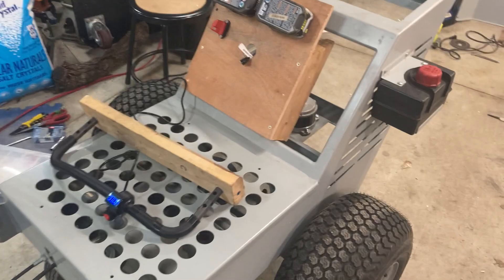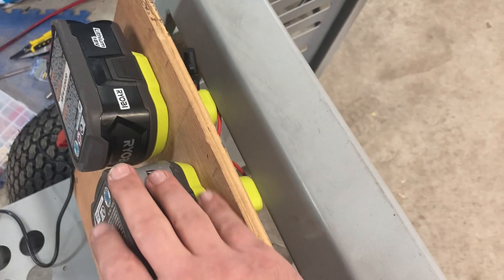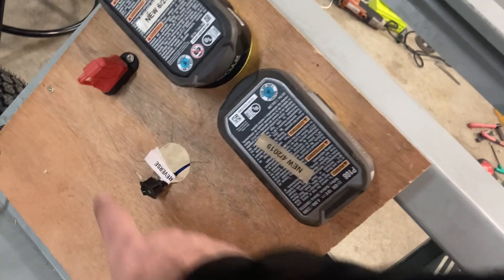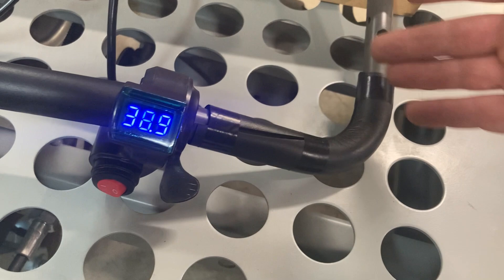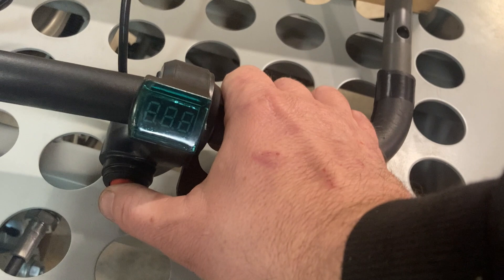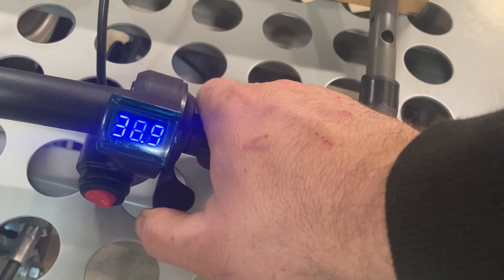I just finished doing a whole bunch of fooling around with this. I've got that little test rig set up for running our Ryobi lawnmower 40-volt electric motor off of two Ryobi 18-volt battery packs. We're using a few parts like the dead man switch and the handlebar from the lawnmower, but down here we've got an e-bike throttle with a voltmeter that also acts as a power-on indicator, and an on/off switch that controls the controller. It's alive — it spins.